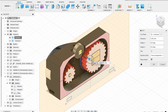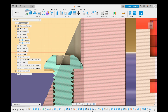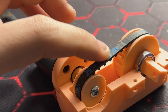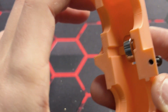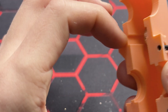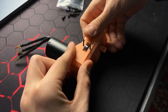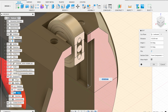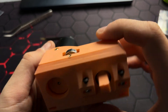Because of the complex enclosure geometry, it's helpful to add all screws and nuts — this approach highlights all potential mistakes. After assembling the reducer, I wasn't satisfied with the belt tension, especially knowing that it could cause issues during operation. The simplest solution I came up with is using a bearing that can slide in the upper part of the enclosure. To increase belt tension, I've added two screws which push the shaft lower. The only downside is possible asymmetry, which requires adjustment, but it shouldn't need to be adjusted too often.